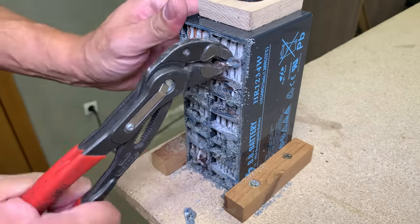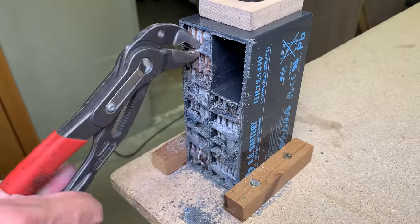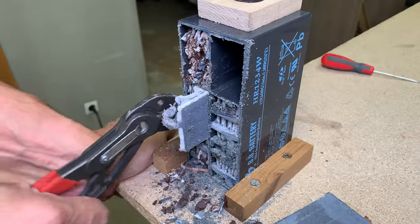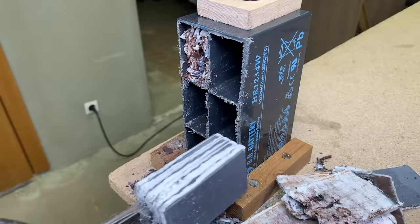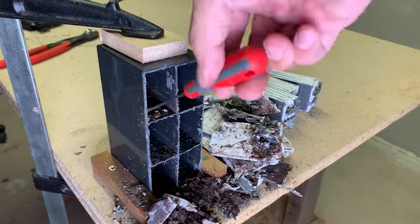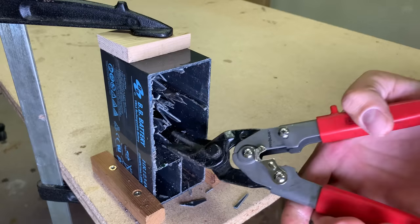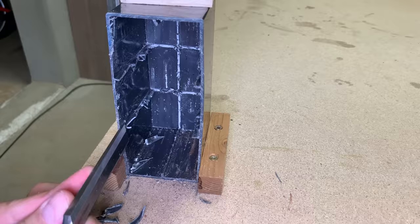Those better looking battery banks were removed very easily in one piece, which could not be said about those crusty brown ones. They oxidized and expanded, which trapped those banks inside their compartment. Scratching and picking piece by piece released the tension, and finally the battery body was empty. Next, I need to remove this internal divider. I started with thin snips to remove the major part, and what's left I finished with a chisel.